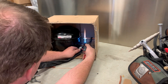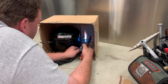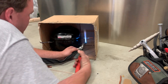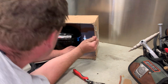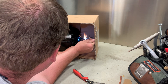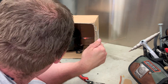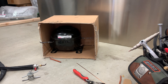As the braze starts to melt, it'll kind of change silver color and eventually go green. The tube slipped in. The back side of the tubing kind of wallowed out on me, so heating it and just putting a little bit in - you look for it to start melting, and then it'll wick around. Then let it cool. Yeah, this is an ugly joint, but that is why it is called practice.